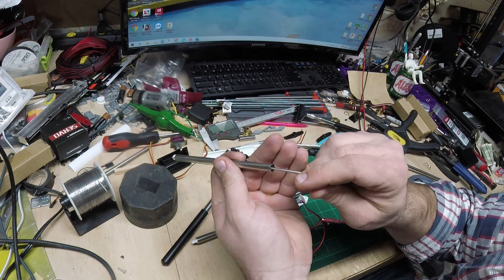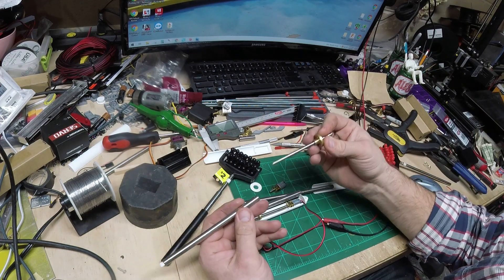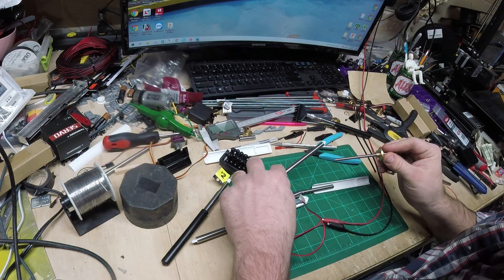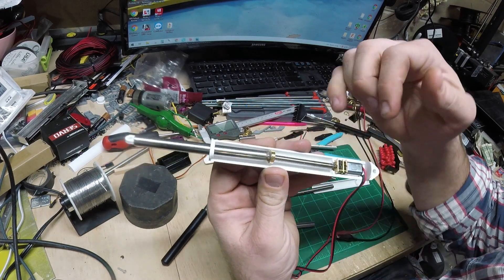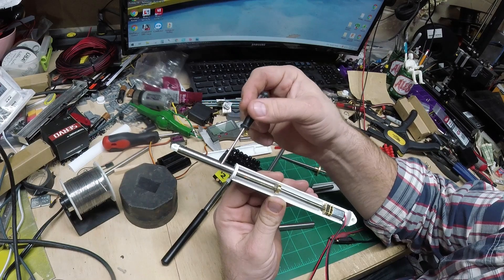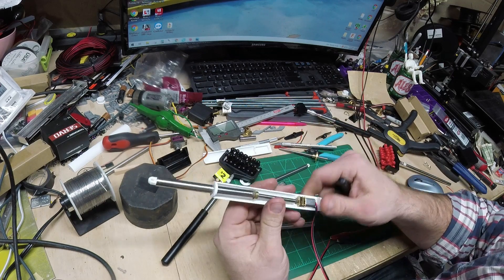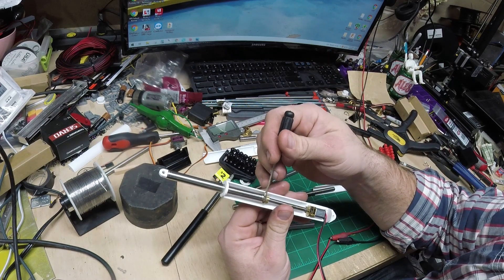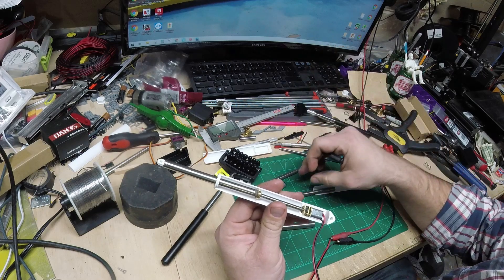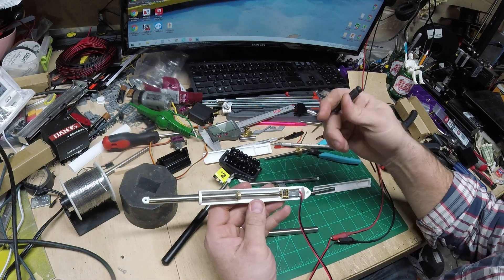You 3D print your piece, shove it in the backside, take a rod and press it into place. Then the last step was attaching this tube to the nut. I found the tube that slid over the nut that was the closest in diameter and decided to use that tube. This tube slides right over that nut, and I just filled it with JB Weld as well - put some JB Weld between the brass and that stainless steel tube and let it sit overnight. It hardened very well. I then took this brass nut to a bench grinder and ground it down to a smaller diameter to fit inside the housing of the cylinder.